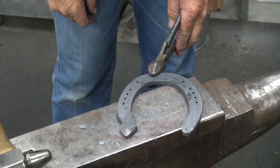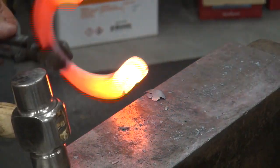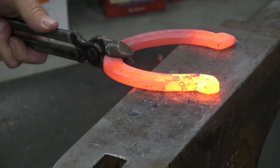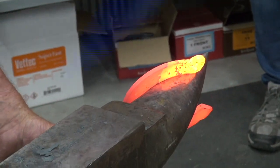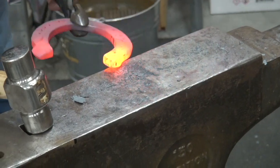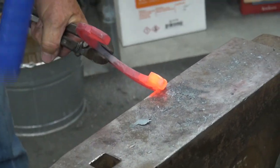I'll do another one on the inside. Take at least an inch of material, drive it into that edge of this anvil. Lower that heel, lower the toe. Kick it almost straight out to the side. Come to your horn, find a spot where you can drive it in. Back to the edge — crisp it up, take the sharpness off, just hit both sides of that.